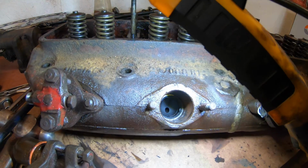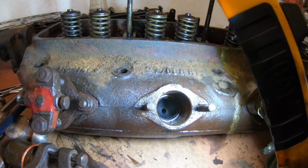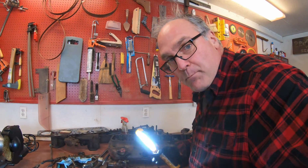Pre-cup engines are good because you can get by with a little less metal in the engine, but they are difficult to start when they're cold. The 656 has a pre-cup diesel engine too, and there's glow plugs going right into the pre-cups to heat that little area to get combustion going in a cold engine. And this is because the compression ratios aren't as high as for a modern diesel engine, where they can inject straight into the combustion chamber and ignite even when the engine is cold.